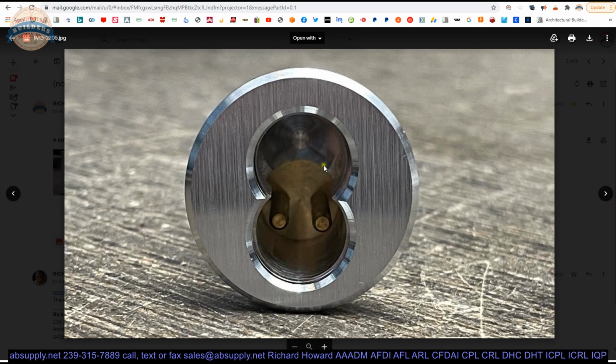When it's equal lobes top and bottom, that is a telltale sign of small format or the best type, however you might like to call that. Again, Falcon, Arrow, all major manufacturers pretty much make small format cores too. That goes to show how incredibly deep the market penetration Best has had for the last 10 decades on this product. That's a fascinating story, the patent of the small format interchangeable core.